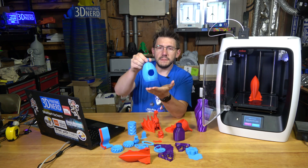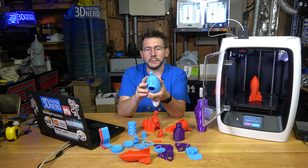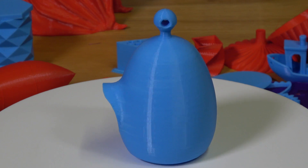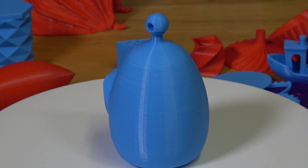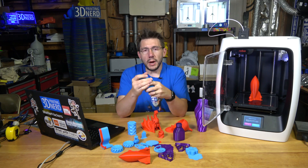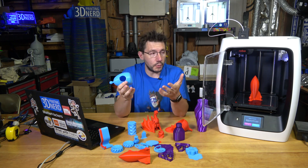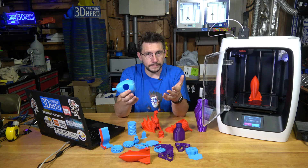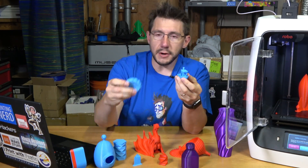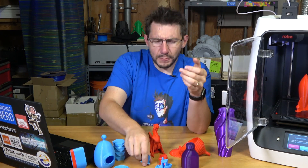One thing that really threw me for a loop was the cooling and how insufficient it is. The birdhouse is an example model from the printer's memory meant to demonstrate what this printer can do. But if you look at all the overhangs, they're atrocious — the printer just couldn't cool the filament fast enough. Braden said they knew about this and were going to outfit the R2s with a new fan shroud. He sent me the model and I'll print and mount it soon. The Benchy looked good and my MakerCoin looked good, but overall this printer really wanted to print well — it just couldn't quite get all the way there.